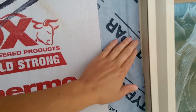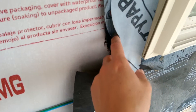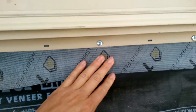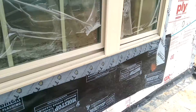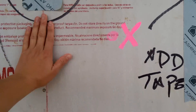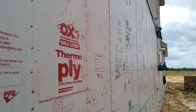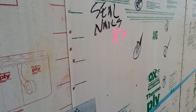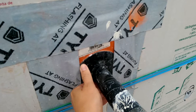This is the window flashing. See, this one didn't tape so well, but they got this bottom flashing right here and they used flashing under here too with this paper. I really do like how they are installing this one so far — no big holes, nice and flush all the way around, seems to be air-sealed tight. This is also what I want to see — it's called Quick Flash, that's what they call it.